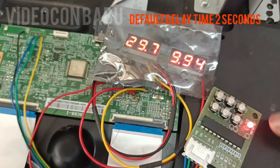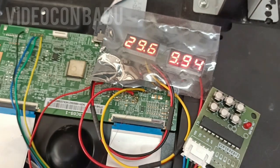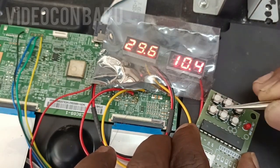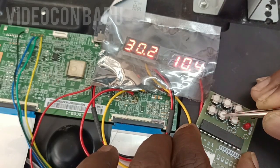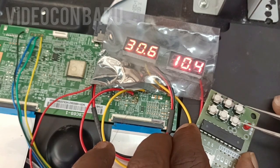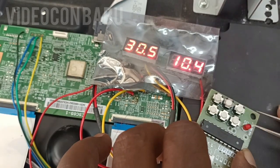See — within two seconds it will get booted. Now I am going to program VGL about 10V and VGH about 30.6V. For the time delay function, select the time delay function by simultaneously pressing these two buttons — VGL and VGH buttons at the same time. See the LED.